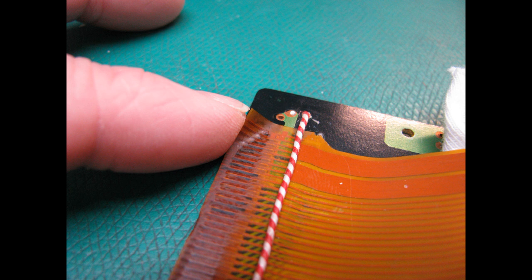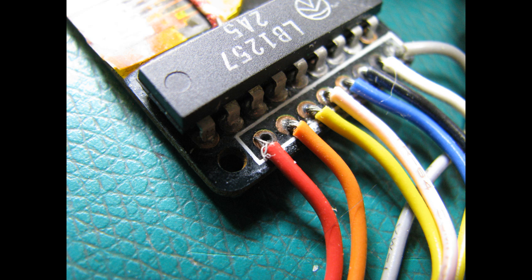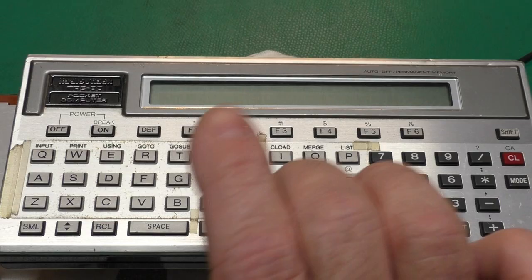I was then worried about this edge of the flex PCB starting to peel up and thought it might be providing an intermittent connection. Sometimes when I pressed on this connection just right, it seemed to work briefly. I ohmed out all the connections from the expansion connector to the PCB and all seemed okay. Knowing that the flex PCB seemed okay, I was really confused as to what was happening, especially considering that it seemed to work at times if I pressed on that side of the PCB. I began to inspect the entire PCB with a lighted magnifier and ohmed out a few suspect traces, which turned out to be okay.